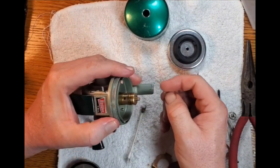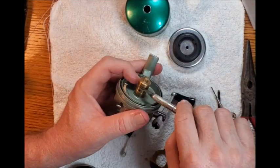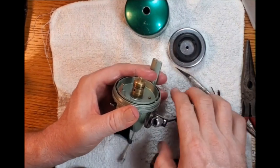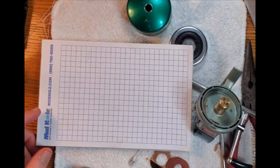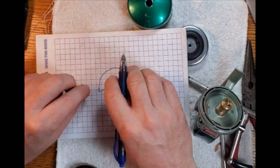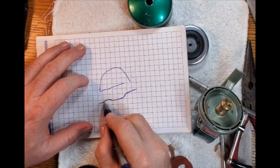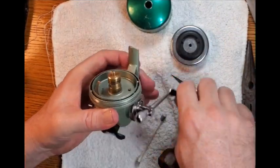Alright — that appears to have fixed it. What happened was there was a little bend in the flat part of the D-shaped spring that looked so geometric it looked factory. Someone may have forced it at one point and pressed it into the shaft, creating that geometric-looking bend, which was preventing the spring from freely moving. I straightened that out and that appears to have fixed the problem. It's now working just fine.